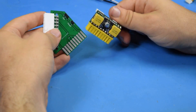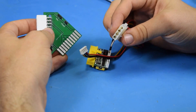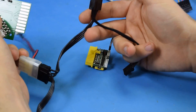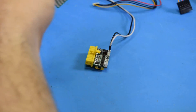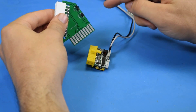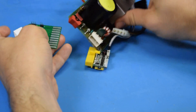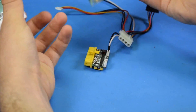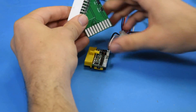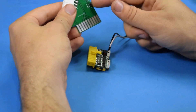Now that I know I'm going to use the Pico PSU, I'll want to come up with a new solution for the 4-pin power connector. Originally I was just going to tap power from the power supply, but that's not really an option now because the power cable is too short — it won't reach over to the floppy drive. So what I'll probably do is add the power connector for that to this board, so you can just power it from there. We're going to have the Molex power built on, I'll keep the fan header, and I'll keep a power header.